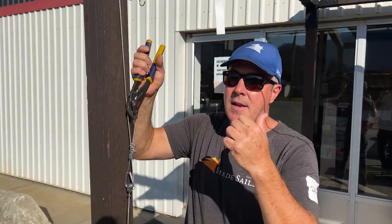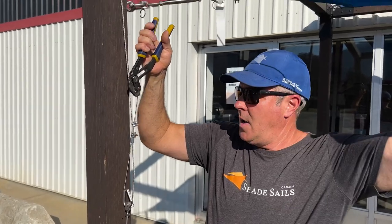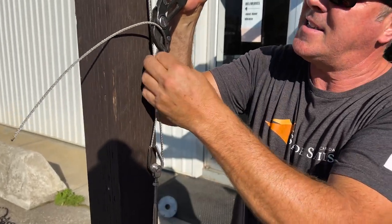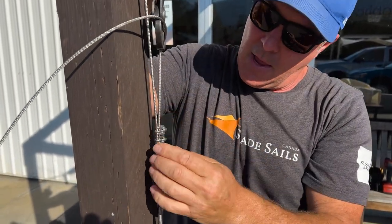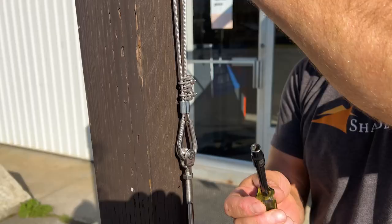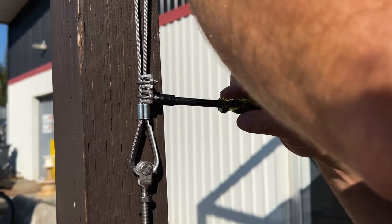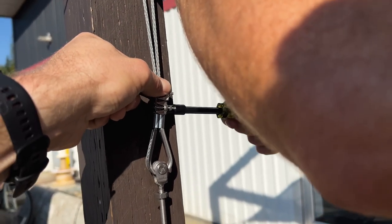I've got my channel locks from my handy shade sail bag and I'm going to use that to help me tighten the cable because it's really loose right now. I've got to pull all this slack up and get this cable nice and snug so that when we go to put our panel up everything is nice and snug. The turnbuckle will do the final tightening. Pull it as hard as you can. This is what that spacer was for — I've pushed it down so it's going to hold the cable in that thimble nice and neat. I've got a nut driver to tighten my clamps. I'll snug those up so the swage is nice and snug against the thimble.